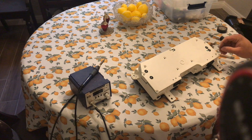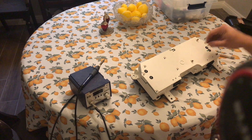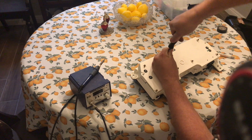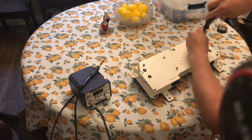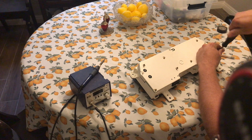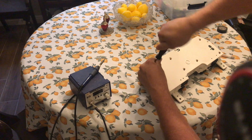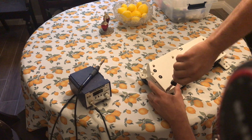We'll go ahead and put the cover back on and then reinstall the screws. I could use a power driver for this also, but they're typically a little more powerful and I don't want to cause damage. One thing to note: it may take me a couple of days to know if this actually did correct the issue, as it did not always occur. It was worse on colder mornings; however, the issue has been getting more prevalent even when it hasn't been so cold out. It used to be that it only did it when it was fairly cool in the morning, and then when the truck came up to temperature it would work fine. But that completes this process here.